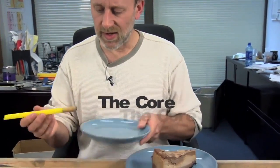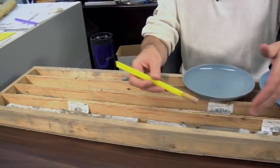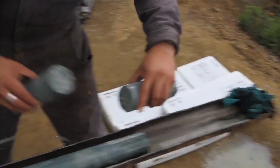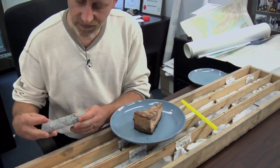Once up on surface, the drill helper would be taking the rock out of the tube and laying it out in the box from top to bottom. From our point of view, that's the most critical part — that's what we're spending all this money to get, this ten-foot chunk of rock. Then they cut the rock in half so you get a very nice smooth surface and it's very easy to look at the geology. Half goes to the laboratory for chemical analysis; half stays as a witness.